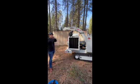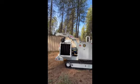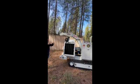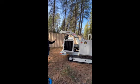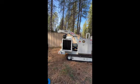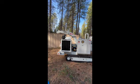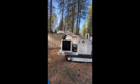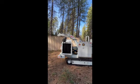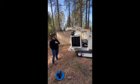Any general questions on the machine, guys? Yes, sir. Oh, go ahead, Rich. Yeah, the air filter, I mean, it depends on the conditions, but how often are we going to change that air filter? Weekly to bi-weekly. Yep. And again, like you said, it's going to depend on conditions. Not replace, I would say check weekly to bi-weekly. They last quite a long time. A year? Not that long. I would say a couple months. Couple months.